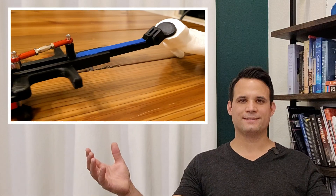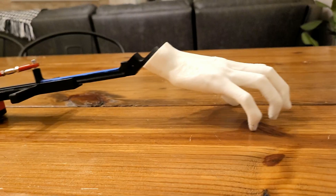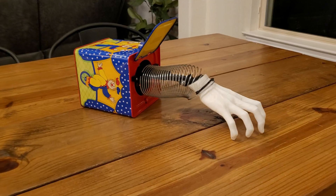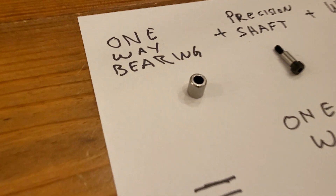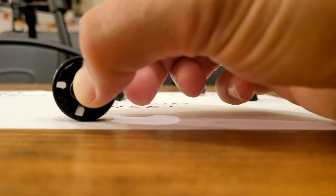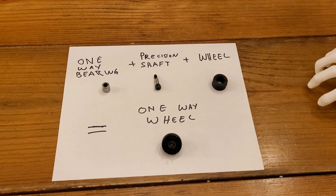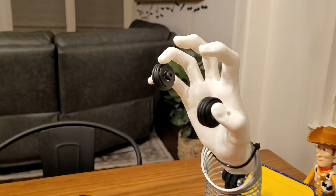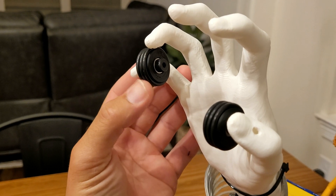As you might have expected, it's not going to get any grip — it's a bunch of slippery plastic and metal, so it just kind of flops around on the table doing nothing productive at all. And that's where one-way bearings come into play. These can only rotate in one direction. My hope is that they would allow it to push forward but not pull backwards, so that it's inchworming along through the use of the one-way bearings. After getting everything in place, let's go do some more testing.